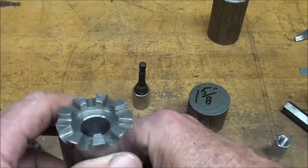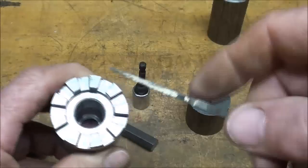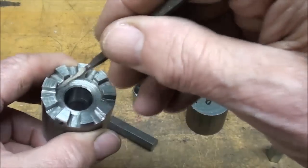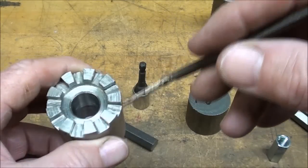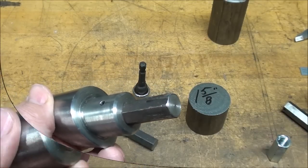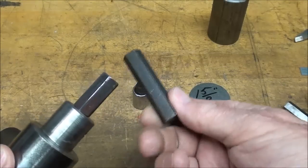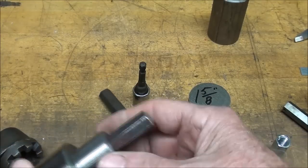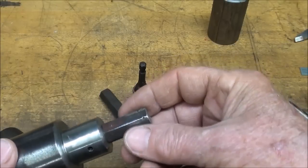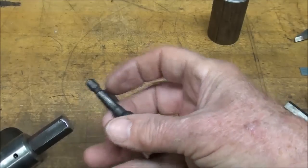When you look into the hole, there's a 5/8" hole going in to about one and a half inches deep, then a 1" hole bored a quarter inch deep — that's just clearance. We've got 9 cogs and 9 spaces for a total of 18. The shank is made from a half inch hex — about a 6" piece, enough to make two of them. You can also make yours from round stock and use a Jacobs chuck, but it's going to slip like crazy.